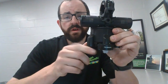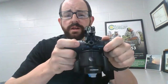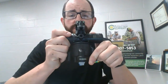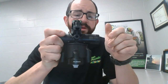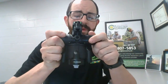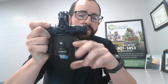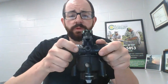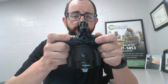In this example, I have an 06 nozzle on number one and a 10 on number four. If we're spraying in a normal configuration going through the field, I can spray out of nozzle one through solenoid A with my 06, or flip to solenoid B and spray out of my number 10 nozzle. I can also spray out of both combined for an effective 16 nozzle, pulsing back and forth at 30 Hz. Each solenoid is capable of 15 Hz max pulsing and 1.5 gallons per minute out of the solenoid bodies.